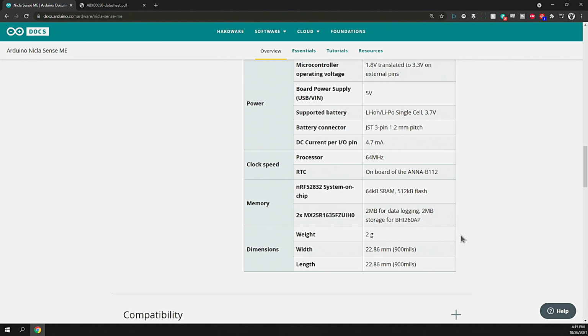The thing that's nice about Arduino that everyone loves is when you upload your sketches, they're compiled and uploaded to the device. You don't lose them when you disconnect the power. So it's permanent. It's not a heavy OS. It basically just has a bootloader that initializes the microcontroller, and then it executes your logic that's compiled from your sketch. It's not prone to error or corruption, so that's really nice. Having 512K flash is good enough for the size chip that this is.